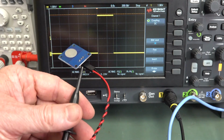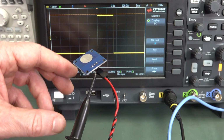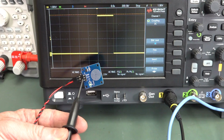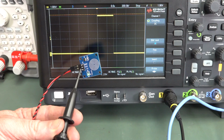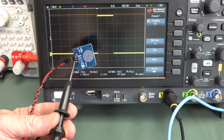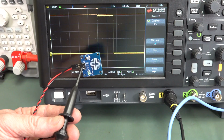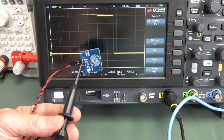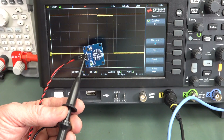And of course, there's a bit of art in designing sensor pads. The greater the size, the greater the sensitivity, but there are trade-offs. There are different pad geometries you can do, and that might have to be an entirely separate video, because a lot of your more advanced touch controllers have interference discrimination and water discrimination. If you get moisture on there, for example, that can cause a problem.